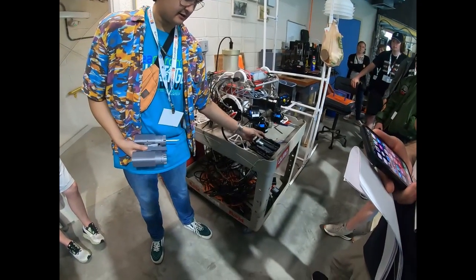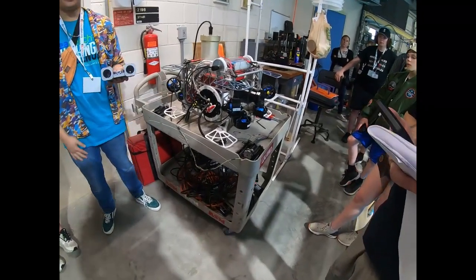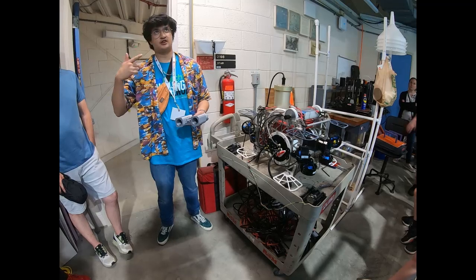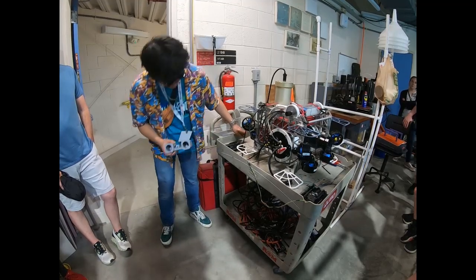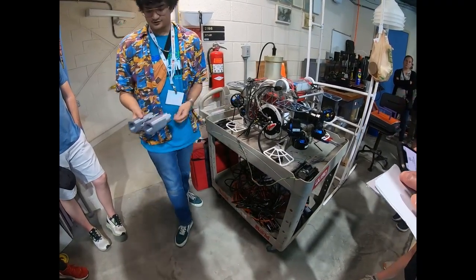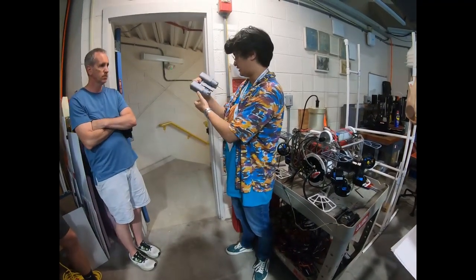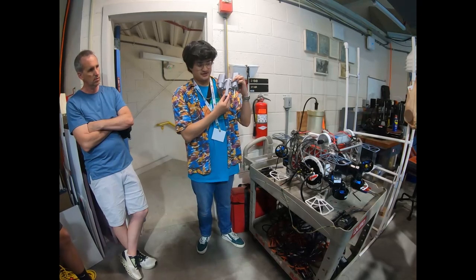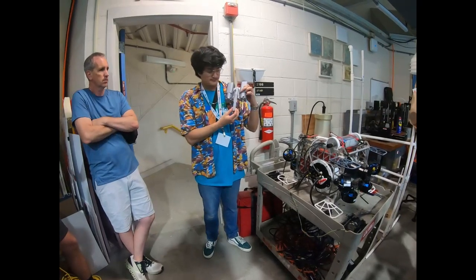You see this is a stepper motor right here, and I don't know how familiar everyone is with 3D printers, but that is actually the stepper motor from my old 3D printer. It uses a linear stepping screw and a threaded rod to take rotary motion and turn it into linear motion. So I'm going to use this broken piece of a torpedo because I can't see the other one. How this works is you have essentially a Nerf gun style thing where you need to pull back these, and that's done by the stepper motor going in the back direction. There's going to be a way for it to hook on there, and bring it back and prime it.